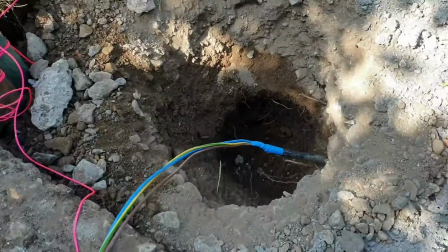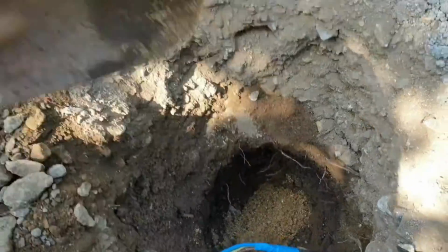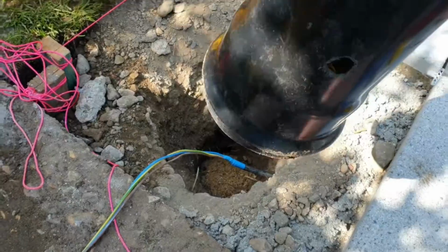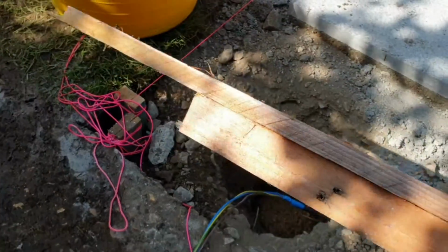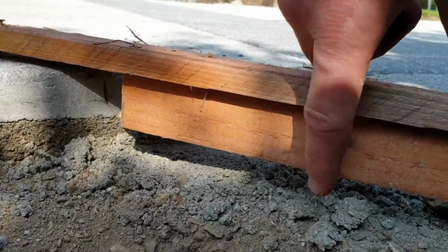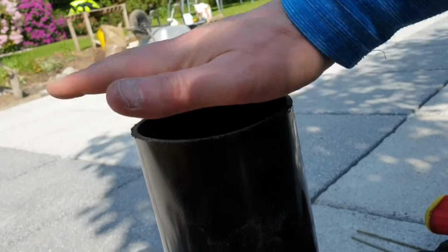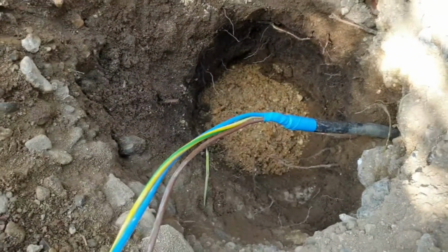The sharp sand is going to allow me to essentially toss some of this into the base. I'll just scoop some of this up now and toss it into the bottom. So I've got sharp sand at the bottom, and I'll probably top that with pea shingle. The idea is that I'll be able to put my 5-inch waste pipe in there, shove that down, and poke the cable through it. What I've done is erect a small contraption here that allows me to level up on the tiles, and that makes sure the top of my 5-inch pipe comes exactly to this. So when my slab goes on, the base of the slab will meet this, and I'll put some silicone around the top of this just to smooth it out, and that will sit nicely with the slab on top of it. And because I've got sharp sand in there, if there's any give, it can be pushed down a little bit further.